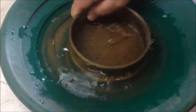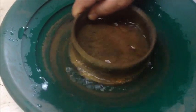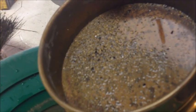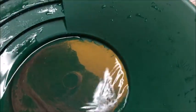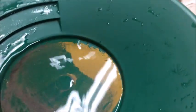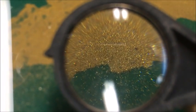We're taking the gold we recovered off the table and we're going to screen it into three different size fractions. This is the 100 mesh screen. There's the gold on top of a 100 mesh screen, and there's the gold that went through a 100 mesh screen. Now this is all the material that went through a 325 mesh screen — you can see how fine it is. We're taking this 325 mesh video through a little loupe, maybe 8 or 10 power.